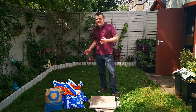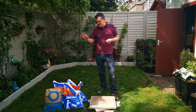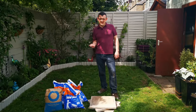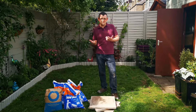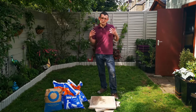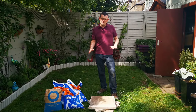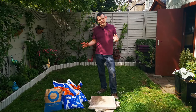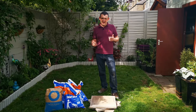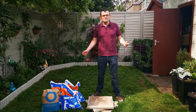I'm going to dig out some of this grass and then level the ground the best I can, followed by a layer of sand and cement mix. I'm going to use a mix of 6 parts sand to 1 part cement. When I've been doing some research for this project I've discovered there's lots of different opinion on what the correct mix should be and whether or not you need a sub base below that mix, but I've decided that this ground itself is already quite compacted. So I'm just going to level it out the best I can, lay the sand and cement mix dry on top, lay the slabs, water it slightly so that the cement starts to set, and then hopefully the moisture in the ground will set the rest of it overnight. So let's get started.